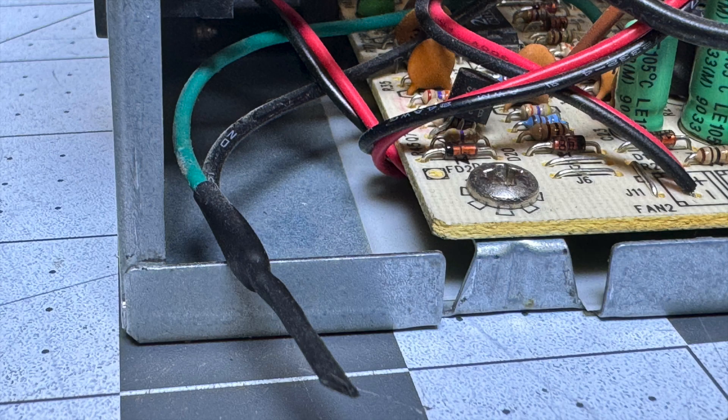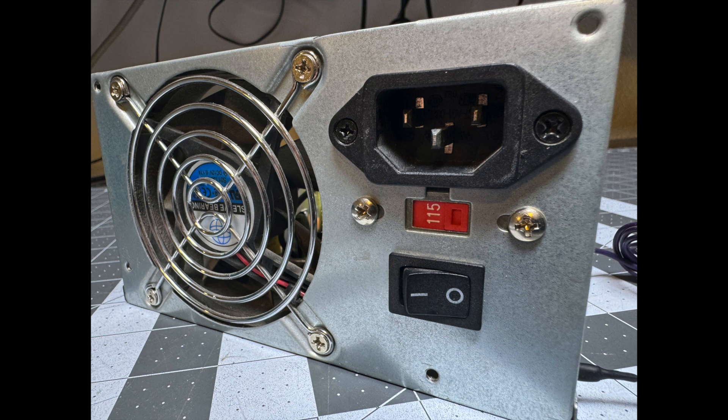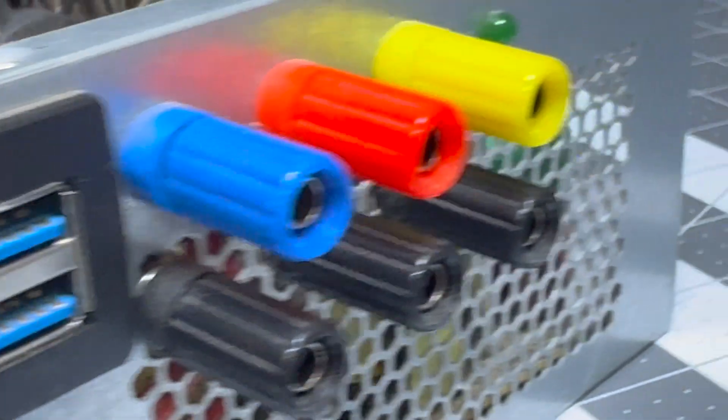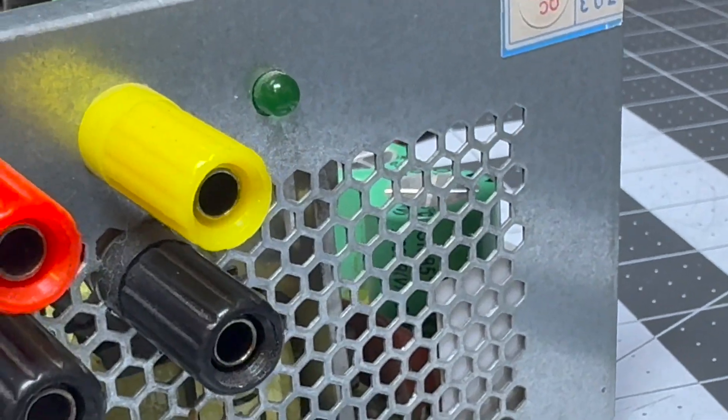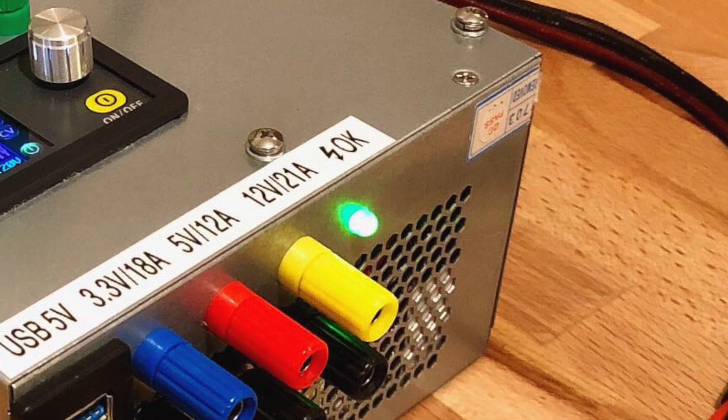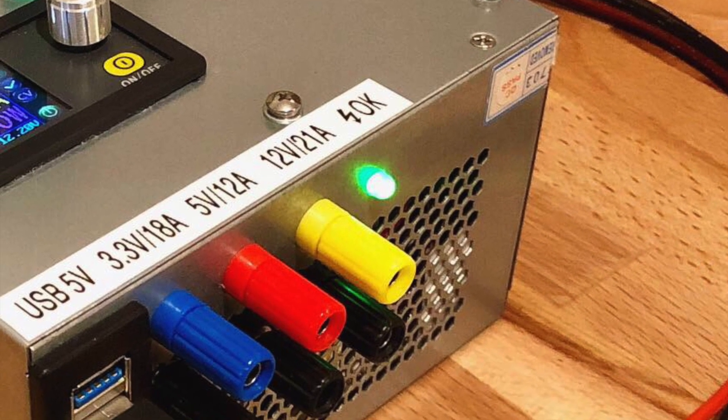So what I did is I crimped one of the black wires to the green wire, in effect making the rear switch into a true on-off switch, and I wired the gray wire to a green LED. The power supply limits the current so you don't even need a resistor. I later put that LED in the front of the power supply case so that I could see when power was within tolerance.